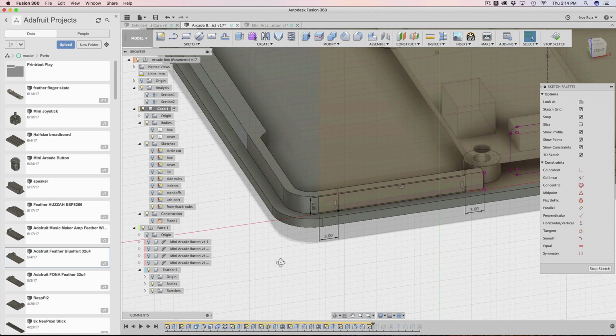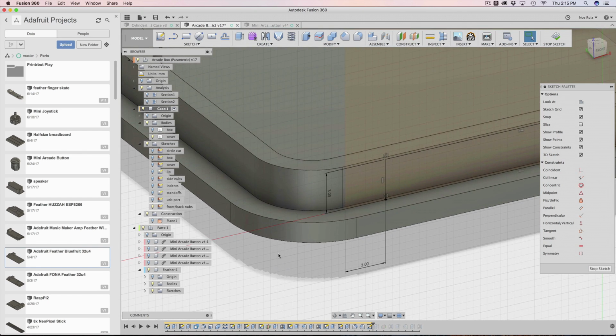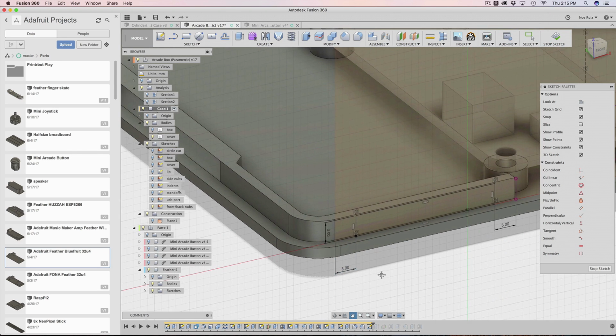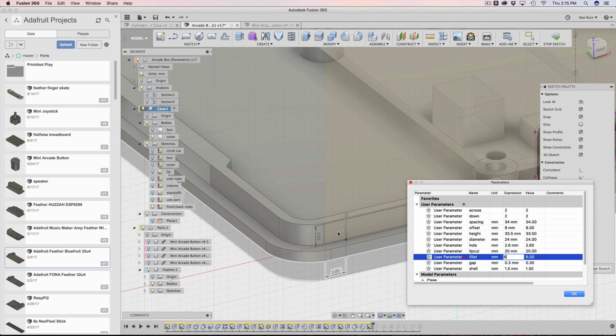This is where the end of the fillet is. So if you ever increase the fillet, this line is going to move. It's important that it's a projected sketch because now it'll shrink depending on the fillet. Let's go ahead and test that out. I'm going to update the fillet and make it 8, and watch. Keep your eye on the 3 here, right where my mouse is. I'm going to hit enter, and you'll notice that it updated.